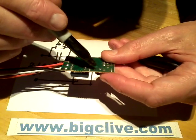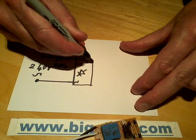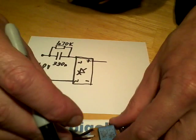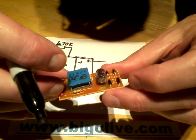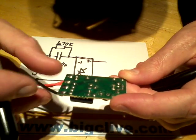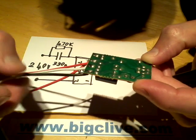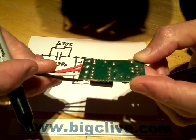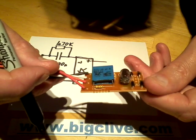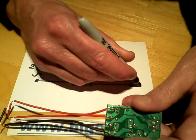and they're going straight to that electrolytic capacitor. So we've got positive coming out, we've got negative coming out. Negative's at that end. Negative goes straight out to the white lead. It's notable that the white is negative and the black is positive here. That appears to be common Chinese colours. So, negative's going straight out to the LEDs,